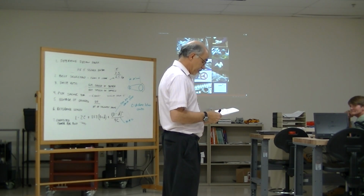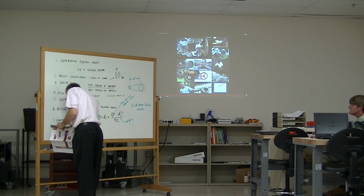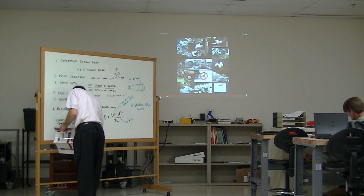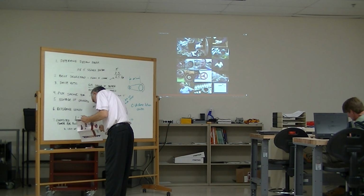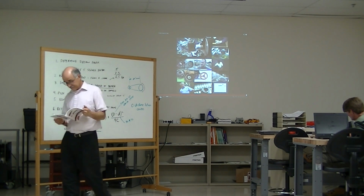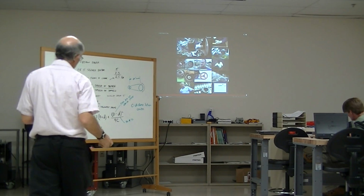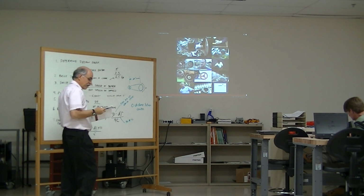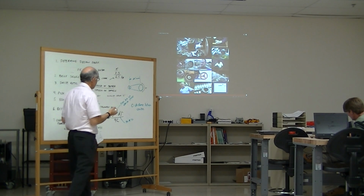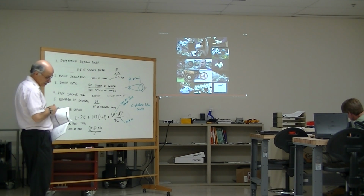So again, this one is a formula. The loss of arc contact is big D minus little d, times 57, divided by C. Now, if you had 2 pulleys that were exactly the same size, of course, you would have 180 degrees of contact here and 180 degrees of contact over here. But when you don't have that, on the smaller pulley, you're going to have a little less contact. In this case, you might only have 150 over here. And on the bigger one, you're going to have a little more than that. So this formula is going to help determine that.